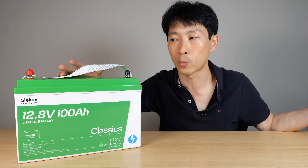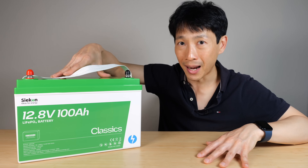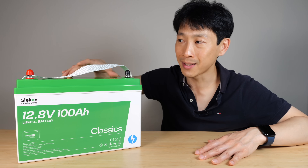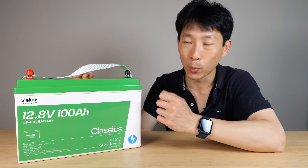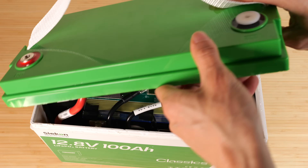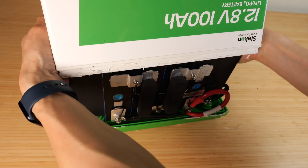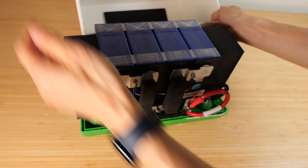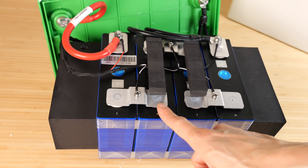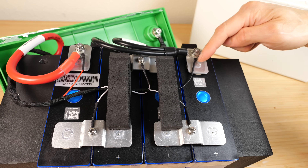Each of them has a battery balancer, but why do you need one to balance all of them? That's because it's not being balanced across the entire pack — the battery balancer in this thing is only balancing the four cells in here. Let me pry open this cap and see what's inside. It's actually really good they didn't glue this into the case, so it makes it easier to remove. The bottom of the case has a little bit of foam. The four cells are in series, spot welded, and taped together on the top and bottom. We can see the battery balancing cables here.